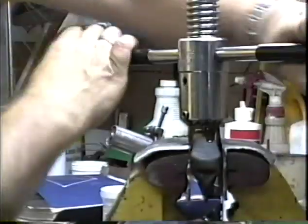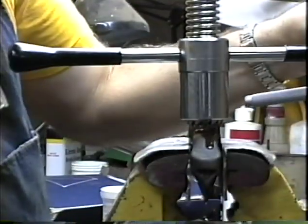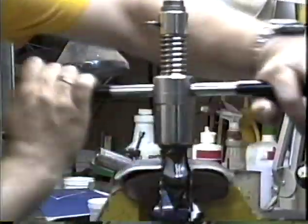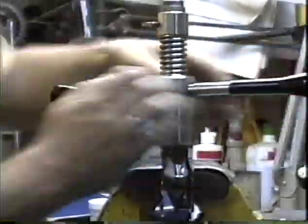You're probably wondering, why has this guy been doing all of his work with Campagnolo tools and all of a sudden he changes to a VAR tool? Campagnolo tool sitting right here. I use the Campagnolo tool for the finishing cut. Do not attempt to make your initial cut with the Campagnolo tool, because I can almost guarantee that when you're all done, it's going to be cut undersize. Start with the larger end of the VAR tool. Cut it to a 27.2 first.